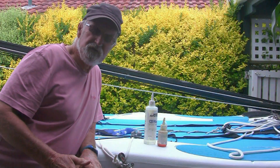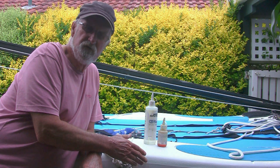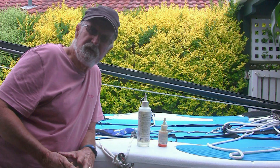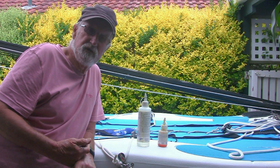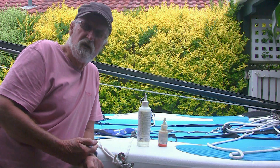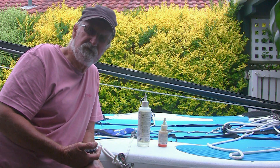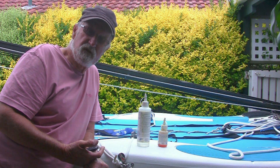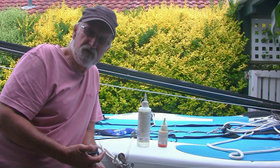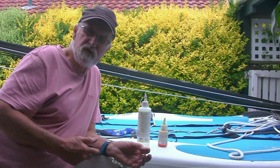One of the big issues with this boat is that you won't find any epoxy that'll readily adhere to it to fill your hole or crack. One epoxy that I've used is G-Flex, which I found on eBay, and it actually does work. I've filled a couple of holes and one crack where the rear beam goes through the boat. One thing you often have when mixing up epoxy is that you try to get it in the hole or crack and it runs out. One method I used with my fibreglass boat was to mix up the epoxy and mix in some baby powder so I had it to a consistency like paste, so you could just paste it into the hole.